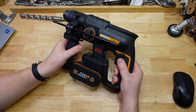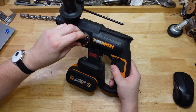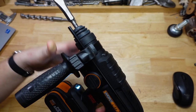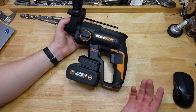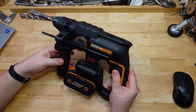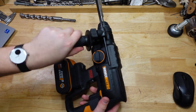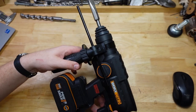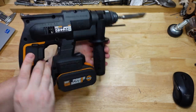It is three modes — you've got the hammer only, so you can do your chiseling no worries. It's not going to be too big or too expensive but it should handle pretty much any job you throw at it — chipping tiles and whatever in a domestic or handyman setting. I do like the fact that the depth rod has a separate adjustment because usually they screw with the handle, but as you can see this actually interferes with you turning the knob. So maybe you just want to swing that around to the other side — but other than that, perfectly fine, nice little unit.